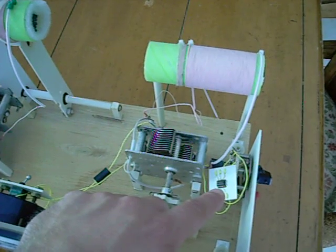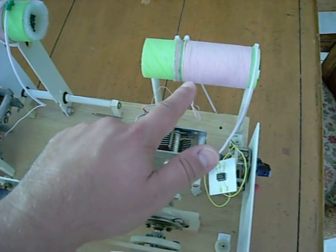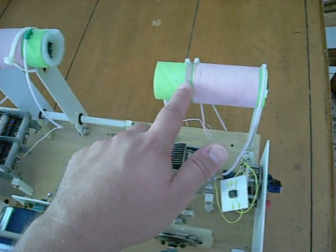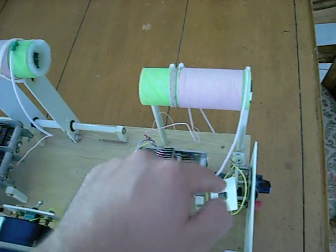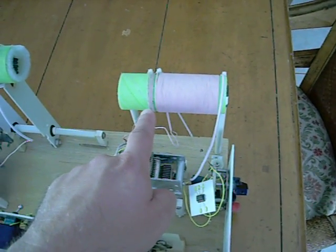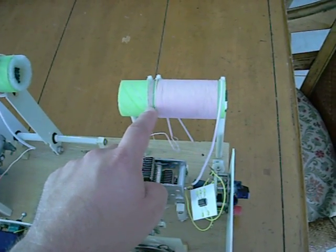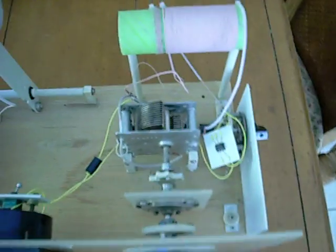The audio is actually taken off the small coil, so this is essentially a transformer. The main tank achieves a high voltage, and the small coil achieves a much lower impedance and lower voltage — that's what I'm taking my energy for the headphones out of. This allows the main tank to achieve a much higher Q, higher selectivity, and higher voltage to drive the FET effectively. But when I go to take out energy for my headphones, it's a very small portion of the total energy collected, which allows you to effectively match your headphones to the tank while preserving Q, selectivity, and sensitivity.